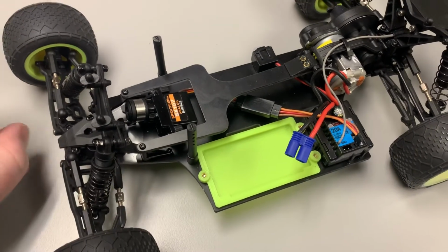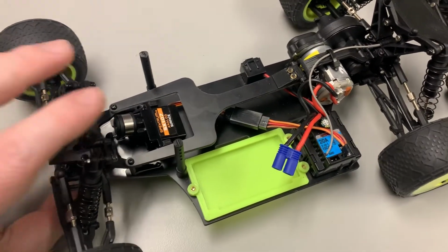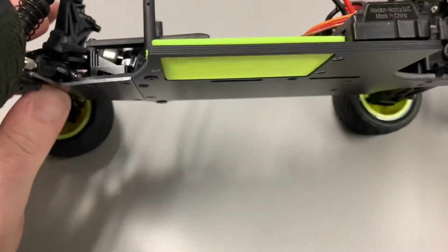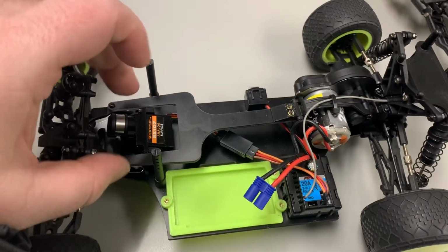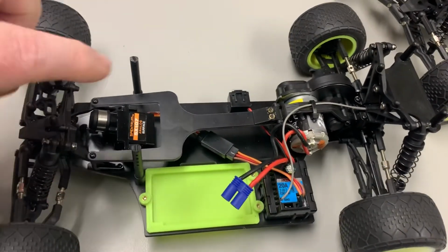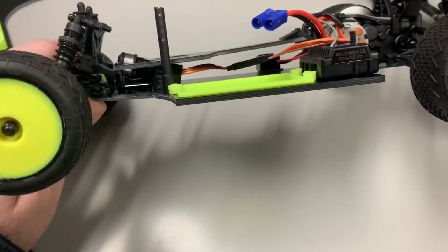So initially when I did that prototype, I 3D printed it, and obviously it had a lot of flex. It was surprisingly rigid, but not enough. So we made it out of G10, and you probably don't even need that upper brace, but just in case, I think it added strength, just so you're not shearing that lip off. Basically, the upper brace provides rigidity from forward to back, and even if it did flex a little bit, it's not bending here to then allow the front to pick up like this and shear that lip off. So I think it's plenty strong.